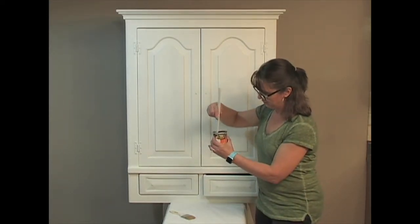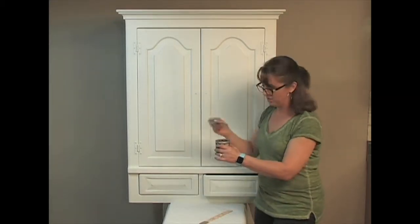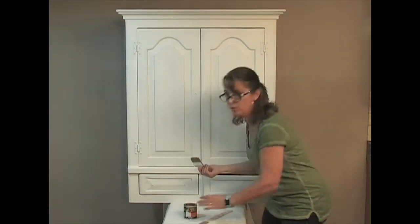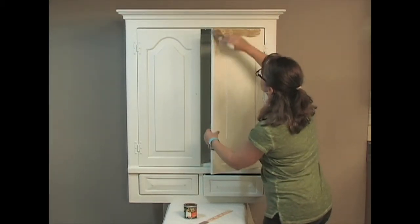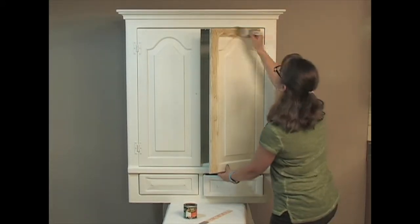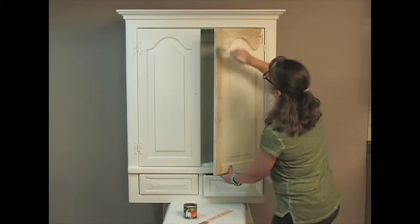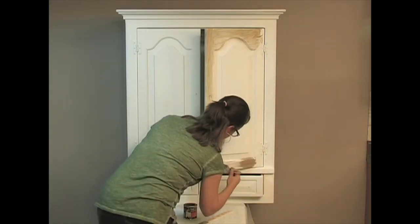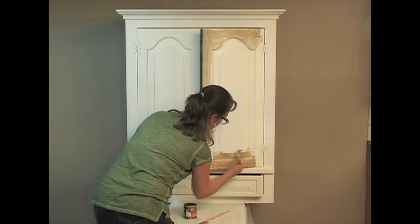This is the first step — we're going to stir it. We've already got our drop cloth out. I'm going to use a little cheap chip brush, which is my favorite. It gives a good look of grain. Work fast, and go in the direction that the wood panels would be on a real piece of furniture. The cool thing is, if you make a mistake, it's very easy to just pull it back out.